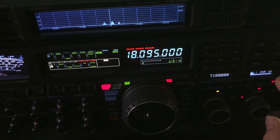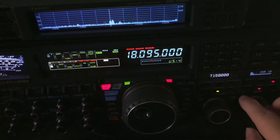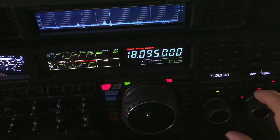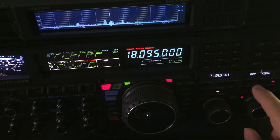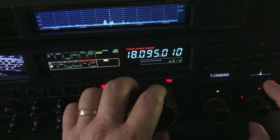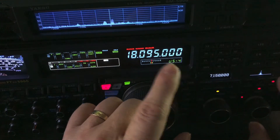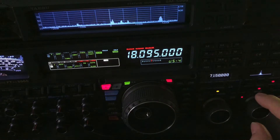I just got to tell you, if I had not enabled this DSP like I did — granted, I had AMP 2 on, digital noise reduction was at 15, had the width at 100, and I slid the APF up 10 hertz. A lot of times I like to leave that zeroed and then move my VFO up 10 hertz. Sometimes I'll do one or the other and see which pitch comes through from the noise floor the best — that's really how I do that.